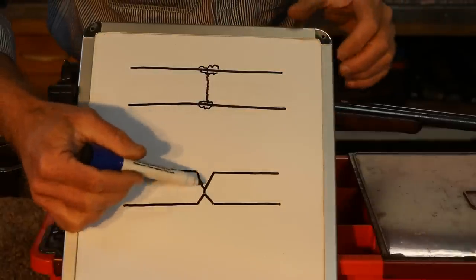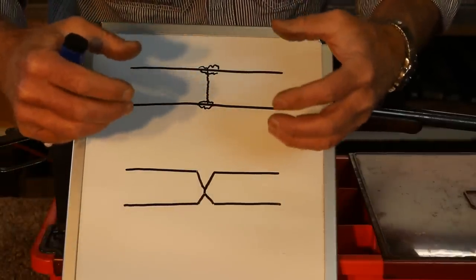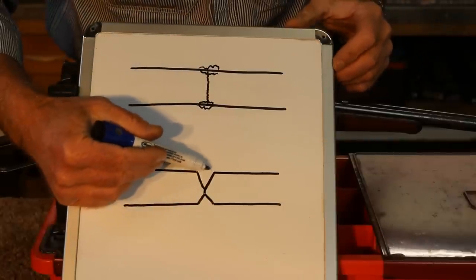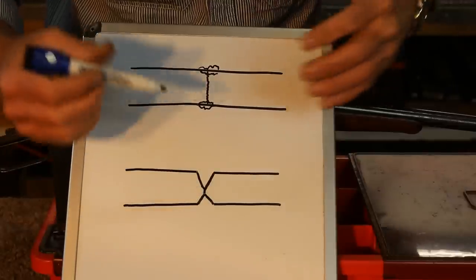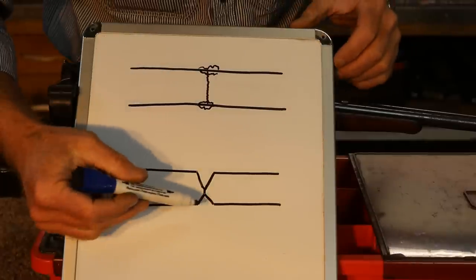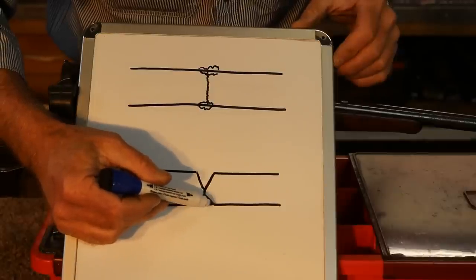So we're going to weld this top and we're going to have to keep it really locked in place, and we're going to have to make some jigs to make that happen. And so we're going to hold that, but there's still going to be a lot of tension there. So when we go back down here and weld a smaller weld on the bottom, then we hope that that tension is going to pull it back and get everything to stay in line. And if everything goes well, we'll be reasonably successful with that.